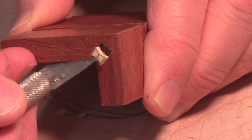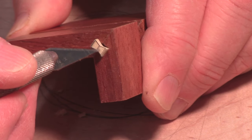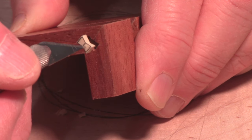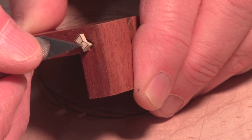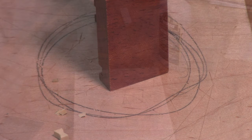What I like to do is take my test piece and make sure that dovetail fits in that slot — and it should not slide in. If it slides in loosely, you need to start over because that's too loose of a fit. You want it to be snug, but not too tight. You don't want to have to drive it in with a hammer. So let me back out and I'll show you how I glue these in position.